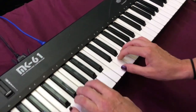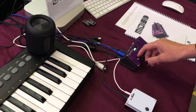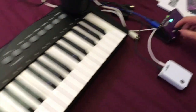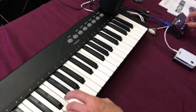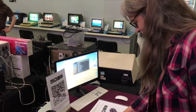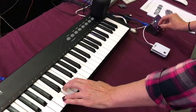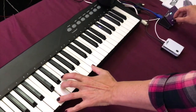Oh yeah, that's a very familiar sound. The SID chip is very versatile. It has different waveforms, filter, all sorts of features. I've built in some presets here, so if we go through them, you can hear the variety of... A lot of sounds out of one chip. An alternative way to play this is to use the voices combined together to give you even more funky effects. The trade-off is that you then have single note polyphony. That sounds great. Portamento.